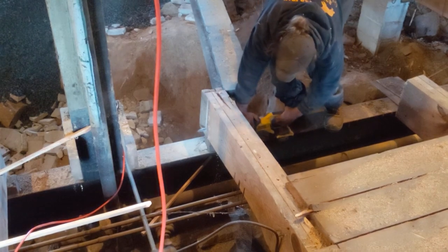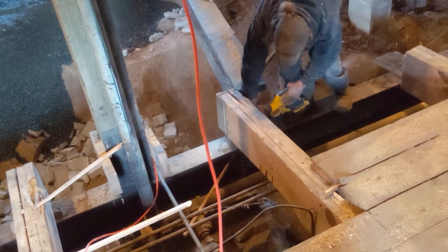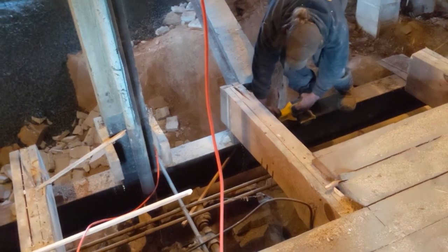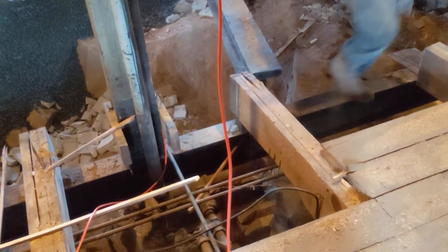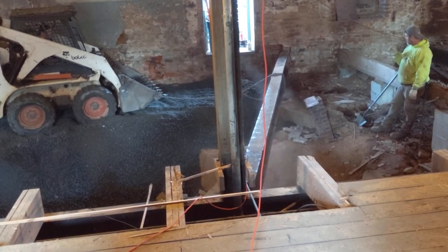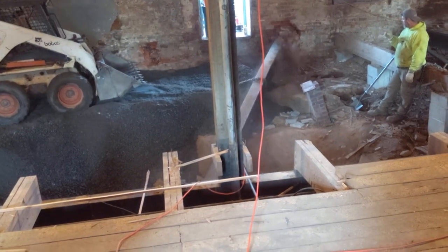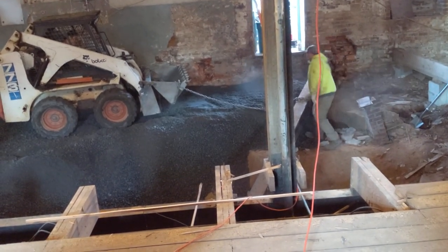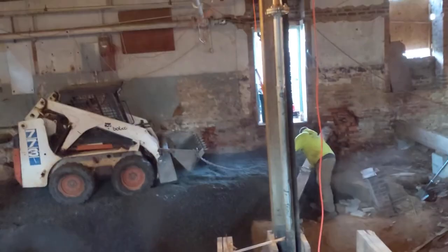That central steel beam is going to end up coming out — it had two intermediate footings across it. You can see in the previous section where we start driving the Bobcat on the structural floor; this floor could handle a lot of weight. What it can't handle with the new distillery moving in is 30,000-plus pound tanks. The dead load that liquid-filled vats will put on the floor — there's just no way a wooden structure would hold that. You could put point loads into the ground, but individual footings wouldn't work if we ever needed to move a tank.